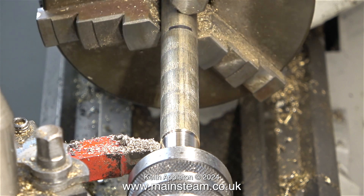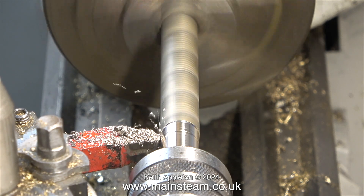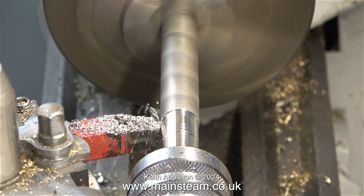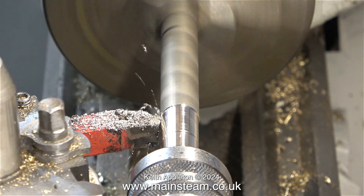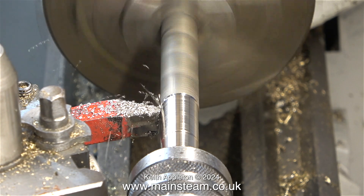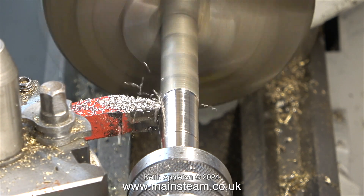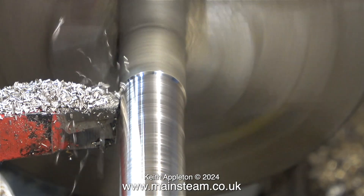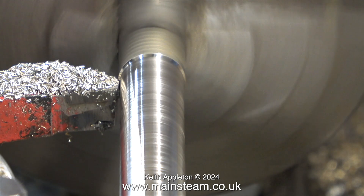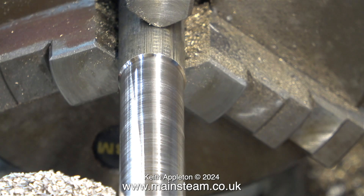The finish I'm getting straight from the cutting tool is really not bad at all. It doesn't have to be perfect because this component will be inside the boiler and will never be seen again once it's silver soldered in position. If I left this video running at normal speed it would be incredibly long, so as usual — even though some people don't like it — I'm running at 400% just to get through the job in a reasonable time. This cutting tool sticks out from the tool post a long way and that's possibly why it leaves rings on the work.